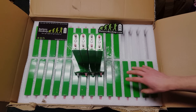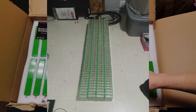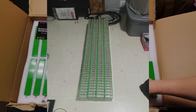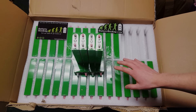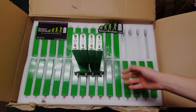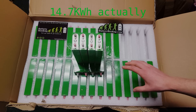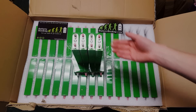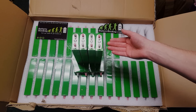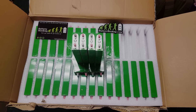The exciting part about this is a friend of mine is actually getting into this — he started small, similar to how I did, and it's just been progressing. He bought 184 of these to build an 8S23P 24 volt battery for basically a home backup battery. He does have solar panels and stuff like that. We're definitely going to be documenting all of this. He's going to end up with a 24 volt, 575 amp hour battery — it's like 14.2 kilowatt hours. It's going to be awesome to get it all set up. Obviously it would be nice to have bigger cells for something this large, but you've got to take what you can get considering the deal. Couldn't pass it up. So we're going to be building out an awesome battery for him. He actually has access to some things that allow him to laser cut bus bars and things of that nature. So it's getting kind of serious — it's going to be a lot of fun.